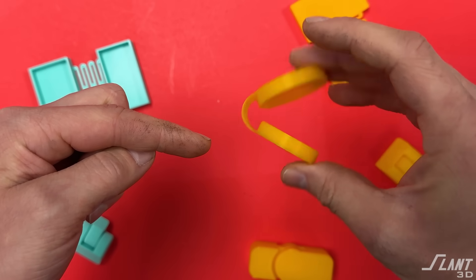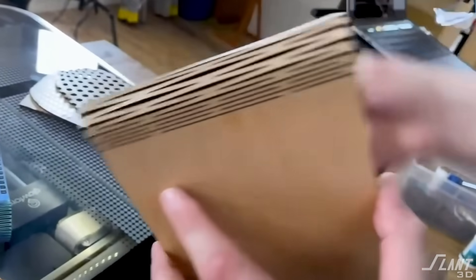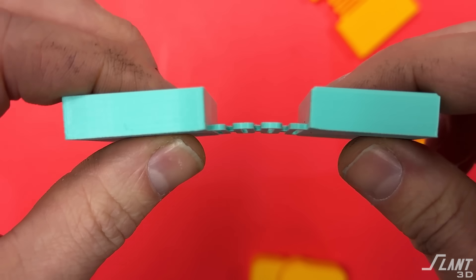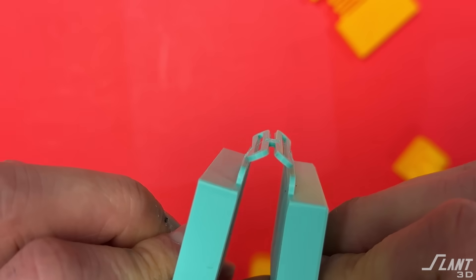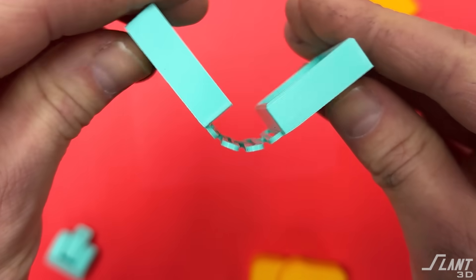But how would you improve this hinge if you wanted to take it even further? There's a type of hinge used in woodworking to allow wood to twist and create hinges, joints, and curves. What this does is give you a lot more ability to create tight corners with a lot less material, so you don't have to create a big long sheet that needs to bend.